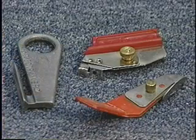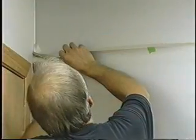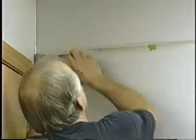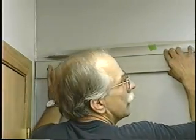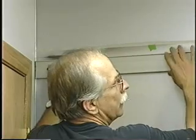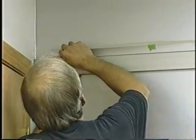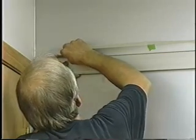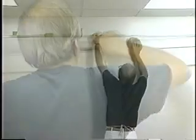Walltalkers recommends a specialized double cutting tool for double cutting all seams. Insert the double cutter and align the blade with the previous razor blade cut. It's recommended to use a straight edge to keep your cut level. When you get 4 inches to 6 inches from the end of your seam, remove the double cutter and again use your 6-inch scraper and razor blade to complete the cut.